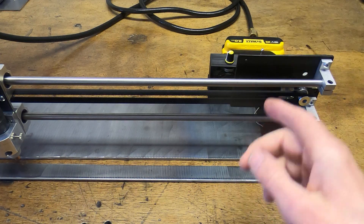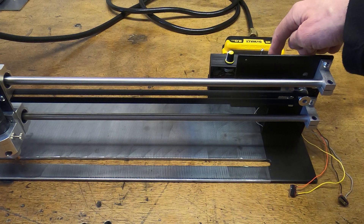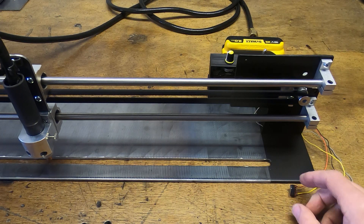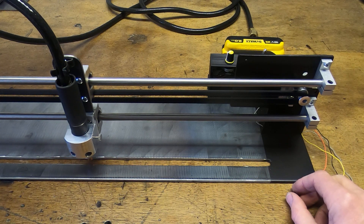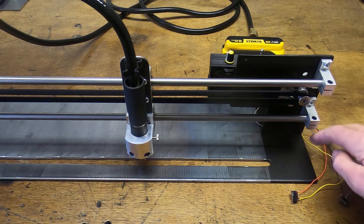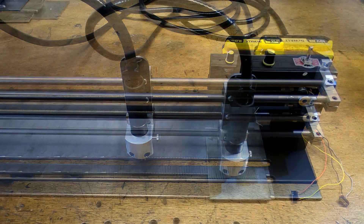During the cut we're under speed control, but I wanted it to run at full speed irrespective of the pot setting when put into return mode — with the switch to the right. It is now running at full speed to the right, and the other micro switch, the home switch, has indeed stopped it. I'll turn it off, wire up the proper switches, get the box fitted onto the back of the panel, and then give it a proper test.